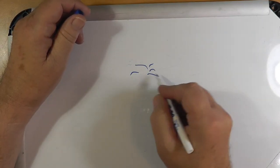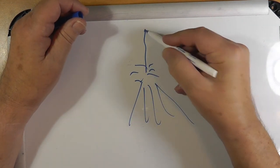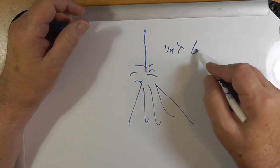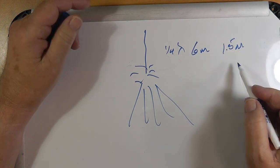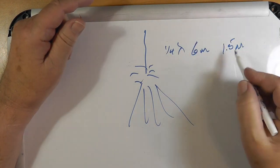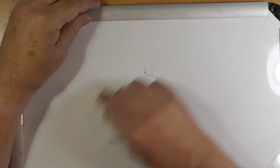So you've got your disc up here and your cone down here. If you put up a rod like this, that's one quarter lambda for six meters — a quarter of six meters is 1.5 meters, so that's quarter wave. They don't usually make them that big, but they'll work on a quarter wave. They'll work for receiving quite well.